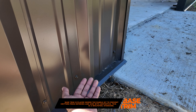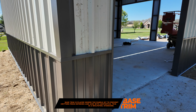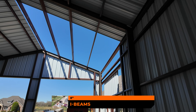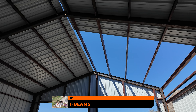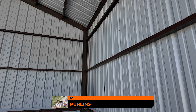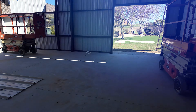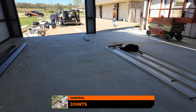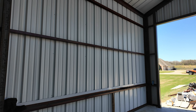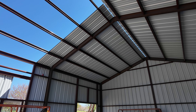The base trim is super nice — it protects that gap because of the panel ridges so no critters can get in. This is standard on our red iron products. We use all I-beams on our red irons — eight-inch I-beams for this 30 by 36 with 14-foot tall, and six-inch purlins all the way around and on the roof. The concrete has nice control joints. This client is also getting the building spray-foamed once all the doors are in.